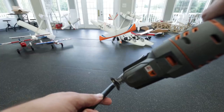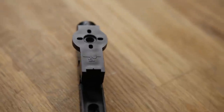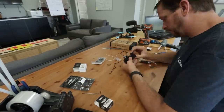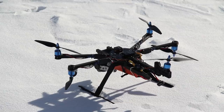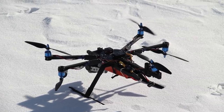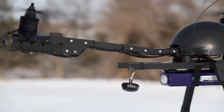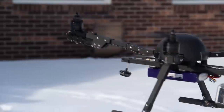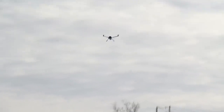Up front, this is going to be a twin-engine aircraft, and Josh is going to be mounting the motors on a boom using our old-school tough tilt tricopter motor mounts. Back in the day before quadcopters became most popular, a lot of people flew tricopters — three motors, with the back motor having a tilt mechanism. This is how the tricopter compensated for motor torque and controlled its yaw. By spinning that back motor left or right, it would cause the tricopter to spin left and right. We developed this tough tilt as a simple DIY solution where you attach a servo and motor to give it that yaw capability. Sadly, the age of tricopters came to an end, mainly because of the simplicity and performance of quadcopters with four motors — more balanced, more symmetrical, and they just work better overall.